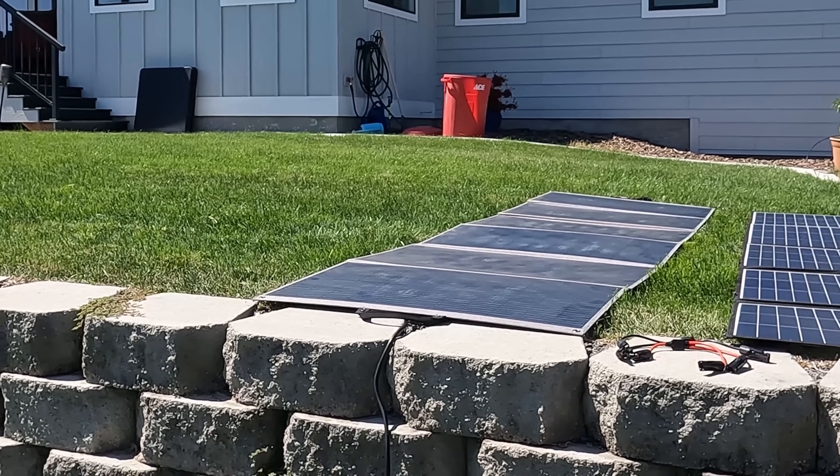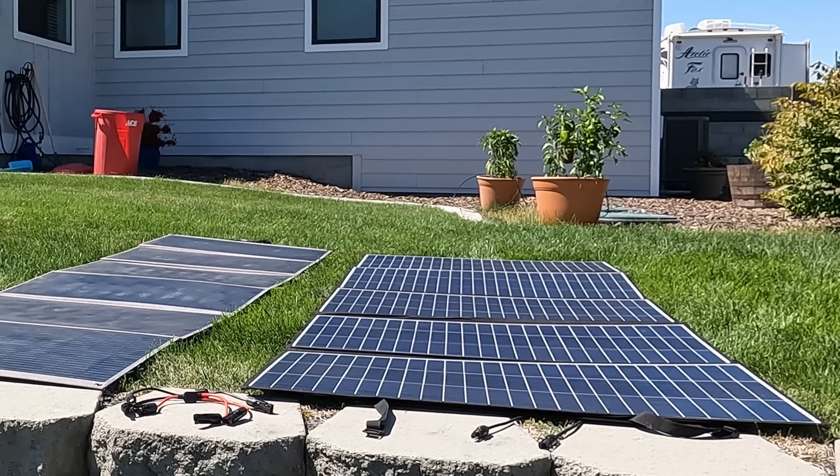I decided to run this test again with two 400W panels of completely different manufacturers. One was an AFRI 400W panel that runs at 26 volts and about 15.5 amps, and one was an AllPowers panel that runs at about 40 volts and 10 amps. When combining those panels, I actually got pretty decent power. In series, I was getting about 65–66 volts running at the lower of the two amperages — just 10 amps. At 66 volts and 10 amps, that's theoretically 660 watts total. The sun wasn't totally cooperating and I had the panels laying flat, but I did gain more when combining those panels than running them by themselves.